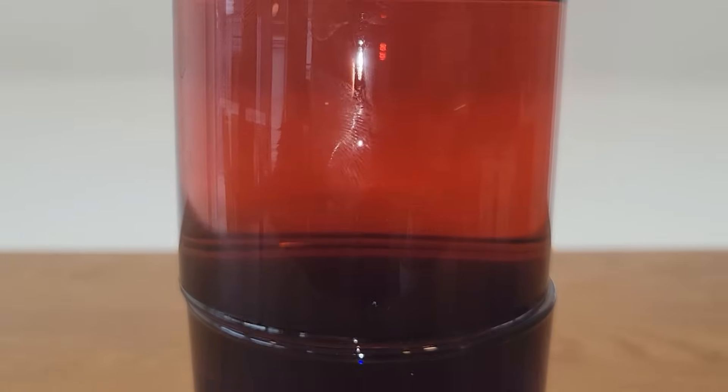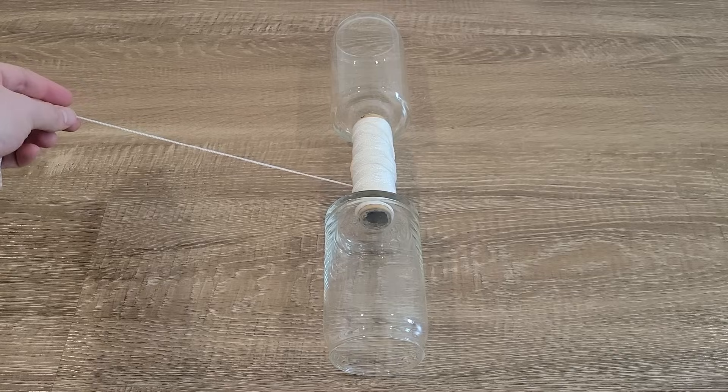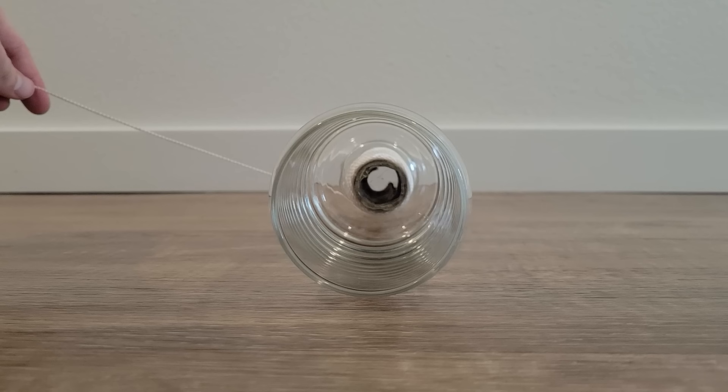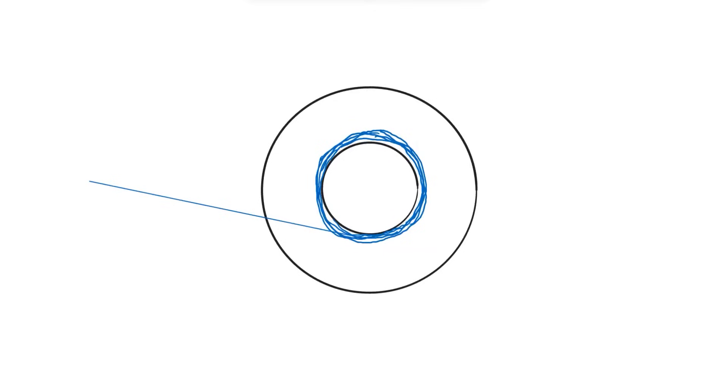Even minutes after the demo you can clearly see the difference in colors. This device does roll to the left when I pull at this angle. The key is to think about what kind of moment is created on the object by pulling on the string. By drawing a force vector on the string and clearly labeling the point of contact with the ground, you can see that a counterclockwise moment is produced, causing the device to roll counterclockwise.